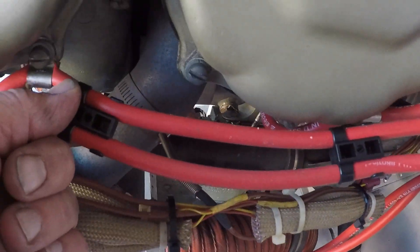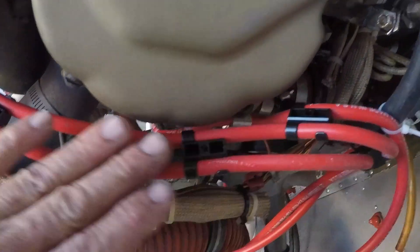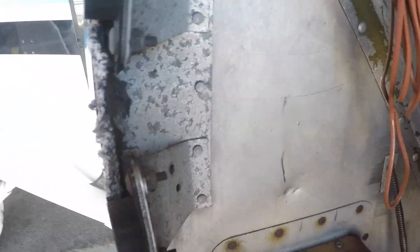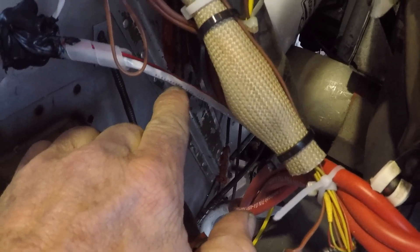The JEGS spacers are about eight or nine dollars for a pack of 16, real easy to install and pop out — at about 50 cents a piece they're well worth it for dressing up your spark plug wires. Now that we have the spark plugs in, the harness done, the mag done, and the coil pack done, we've wired in the mag timing head to harness, sent the power and control wire over to the coil pack, pierced the firewall and sealed it up. We also sealed up a couple of other spots that were leaking air on the engine to help it run cool.